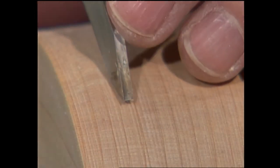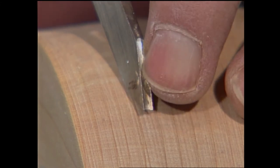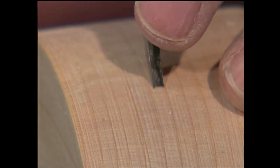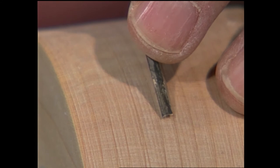I'm going to use a little specialty parting tool. As you can see, this is a really tight shot here. They cut a groove in right here, and by making that groove, when you look at the tip, there's two little barbs. So when I start to make a cut with this, I'm going to etch in beautifully. It's going to make a nice, clean cut. I'm going to use this to part off the solid surface material blank.